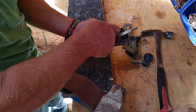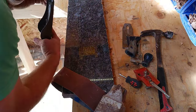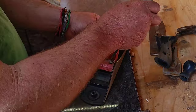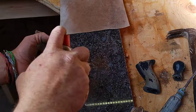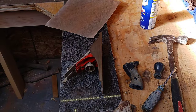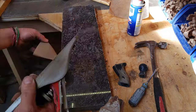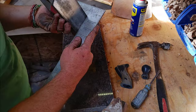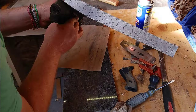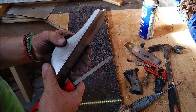The first thing I'm doing is just knocking off the rust on the bottom of the shoe of the plane, and then I'm reassembling everything so I can have the bolts tight and make sure that everything is kind of bent into place. Then I'm sanding everything again, being sure to check that the sides are roughly 90 degrees from the base of the sole. Lastly, I take the file and round off any corners in case there are any burrs I'm missing.